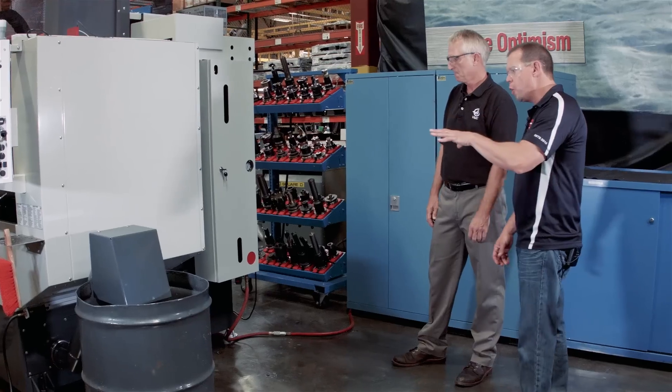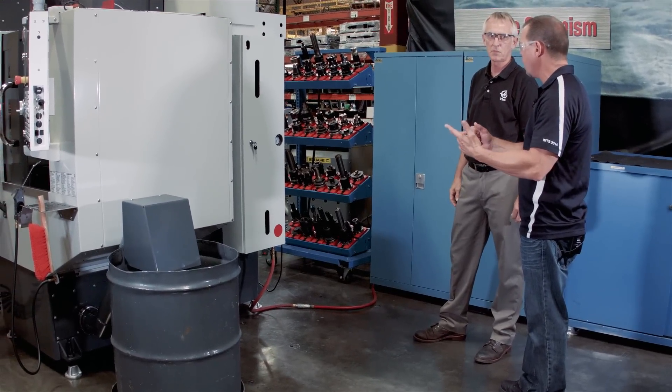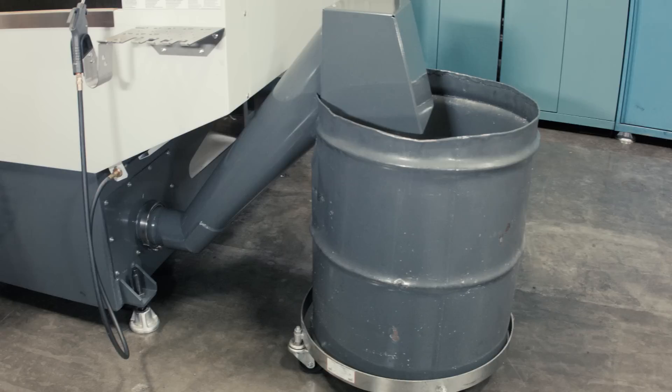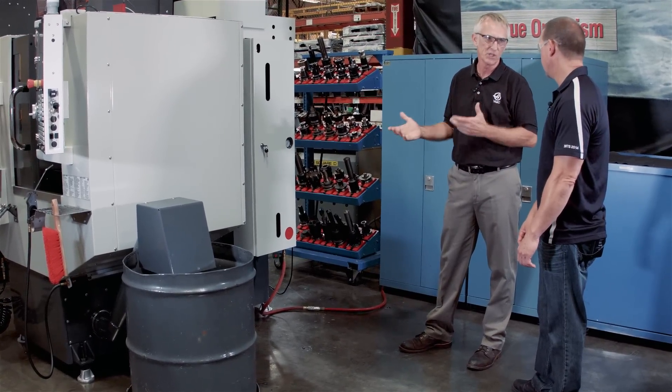I know you guys made some changes to the auger — a little about the history: the Mini Mill at first didn't have it, then you added the auger, so what's different on the newly redesigned machine? We added the auger a few years after the introduction of the Mini Mill — it was kind of a compromise; it sat on top of the tank. With the new tank, we've actually got the auger lowered down into the coolant a little. We shaped the tank for the auger, so it's designed around the auger. It does a much better job of getting the chips out of the machine — it's more like a big vertical in that respect.